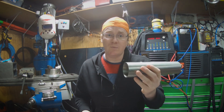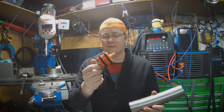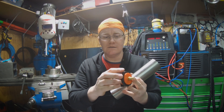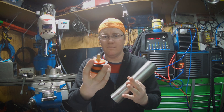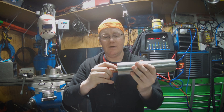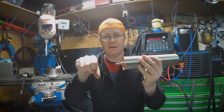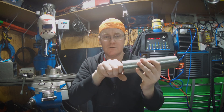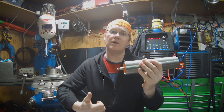When you're purging this stuff, I use these guys here — again, that's the set from purgeplugs.com. It's basically just a plasticky center hub with some foamy material on the outside and a diffuser. You just shove this into your pipe. I use quarter inch polyline with a pneumatic fitting, chuck it on there, and that goes to your dual flow meter.